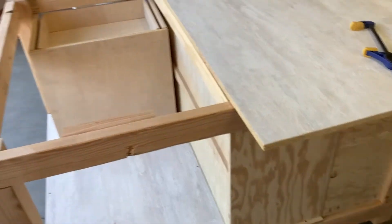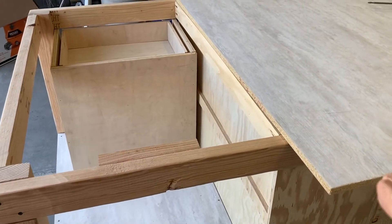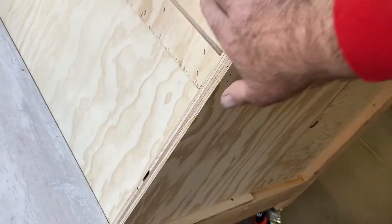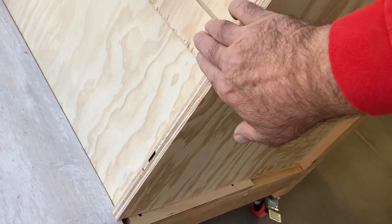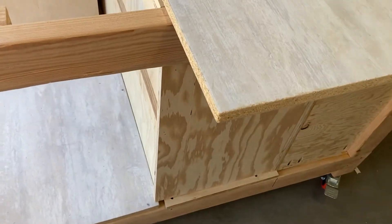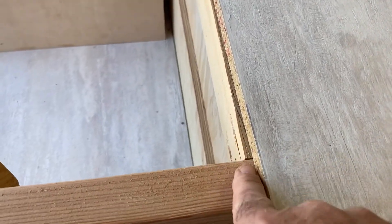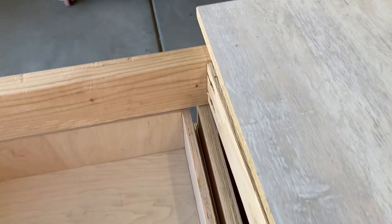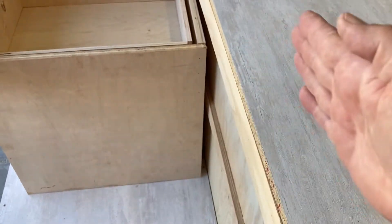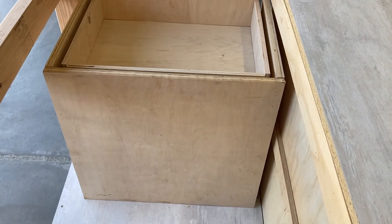I made some drawers in a separate cabinet that I'm going to attach to the bottom. The reason I made it separate is because I couldn't trust the scrap pieces — this wall is actually two pieces glued and nailed together. I had a bunch of pieces all at a set dimension already. You can see there's probably a good 3/16ths gap here and it curves down to nothing then back up, so I didn't want to build that side of the cabinet against that wall. Easy enough solution: find more scrap and make yourself a drawer box.